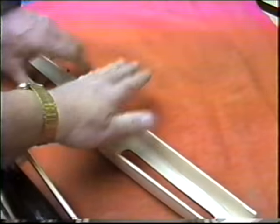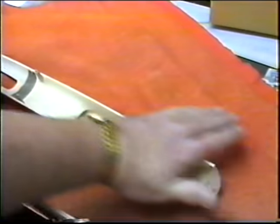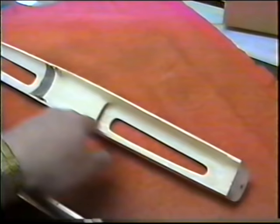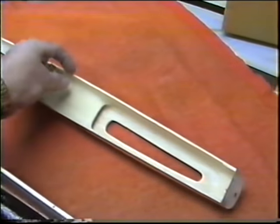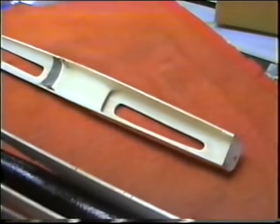When you say glue it to the table, you mean? Glue it to the plywood. Oh, glue it, oh yeah. In other words, take a sheet of plywood. Right. And glue the whole plywood down there. Then when you're done, of course it cuts with a scissors, cut the outside out, a little bit oversized, and then inside, you can cut the inside ahead of time if you want to make it easy. Okay, but leave a quarter inch lip, because that keeps it from doing this. Oh, okay. And it makes it nice and solid.